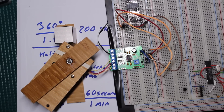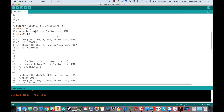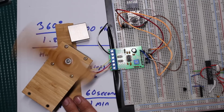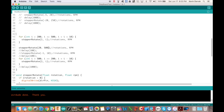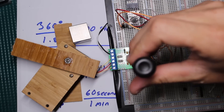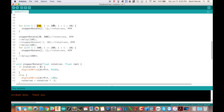If you don't want to use RPM-based code and you know your step angle divided by 32, you can step directly. Another important tip: you can't just start these motors at 500 RPM straight away — you have to ramp them up. Here's a simple acceleration example: a for-loop starting at 200 RPM, ramping up by 10 RPM per rotation.